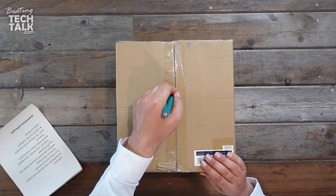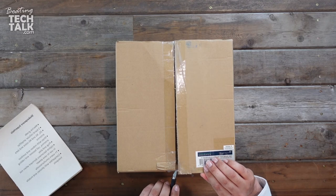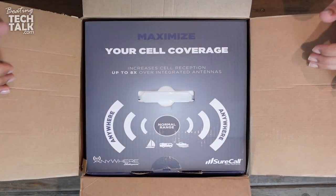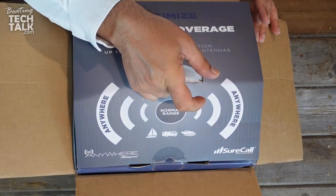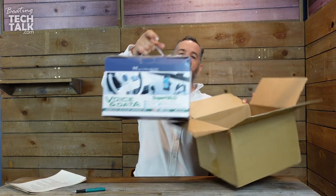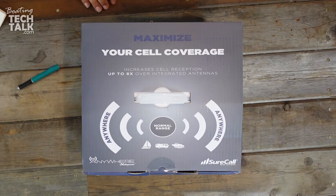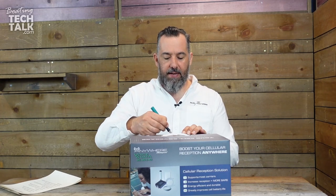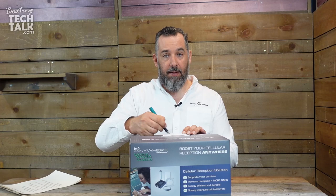Let's start with opening the box. Also worth noting, there are other products called Wi-Fi extenders and that is a separate product. The Superhalo from Shakespeare is really a product to have a little bit of mobility within a boat. What it means is that you have an external antenna, an internal antenna, and then you have the amplifier. But here's the catch — the further away you are from that internal directional antenna, the signal does degrade quite a lot. So you can't put this device in a really large boat and expect miracles if you're far away from it.